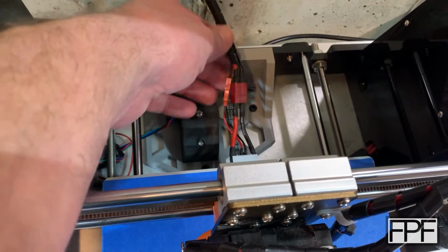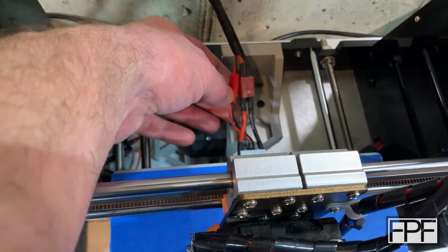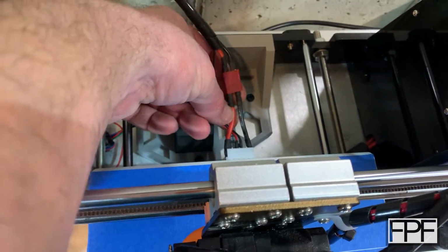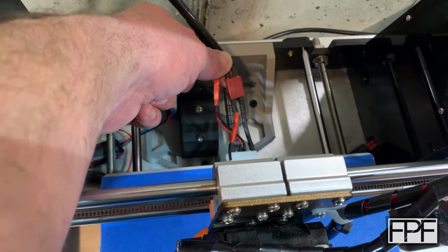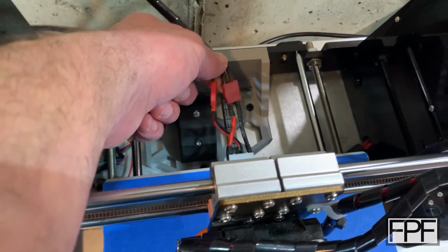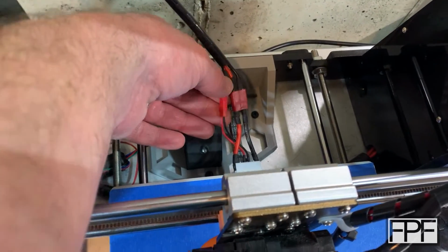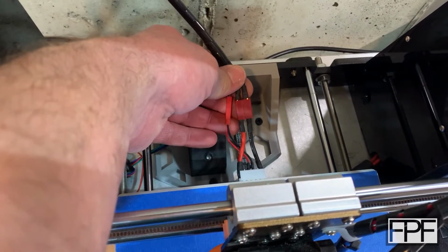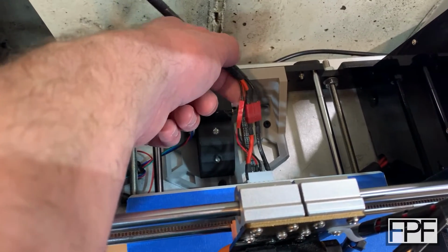I replaced it with these, and then I also put couplers on here as well. This is for the thermistor. This is a JST style connector, and this is a Dean's style connector for the rest of the heat bed. I'll link to these parts. The Dean's connectors were largely replaced by, I think, XT60 connectors in the hobby space. This is where the Dean's connector came from, the RC hobby space. You could use a Dean's connector, which there's plenty of copies of on Amazon, or an XT60. I'll link to both down in the description of this video.